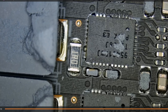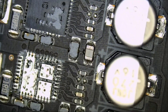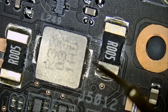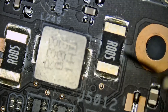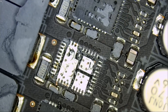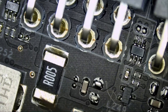I already removed the component. I had to cover the capacitors because they can blow if exposed to a lot of heat. After removing the suspected component, we check the 12-volt line again and it now reads 0.43 voltage drop — the short is gone. We figured this out by just doing visual inspection. A solder blob is a very good indication that the component is at fault when you have a short circuit on one of the 12-volt lines.